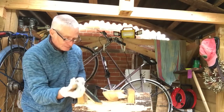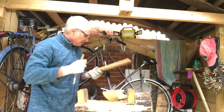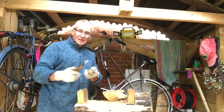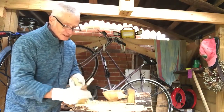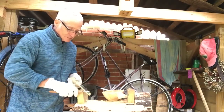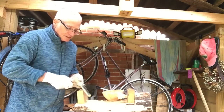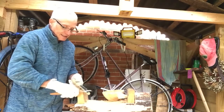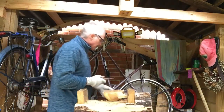As soon as you start to feel the blade working a little bit too hard, just give it a few stropping strokes. Now, the curved blade, you need also a doweling. You could use a piece of doweling, stick an old piece of leather belt on there, and again apply the green stropping compound and just remove the burr which is formed as we've stropped the outer edge. You just do the inner edge. You know you're taking material because it goes black. Just very, very little material.